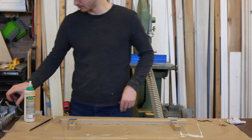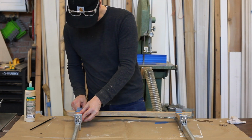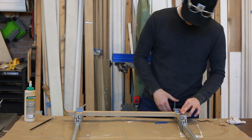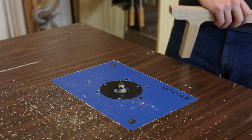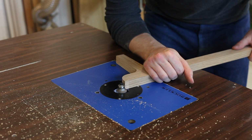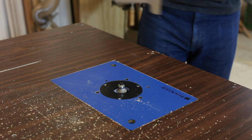And you can see right there the blue tape. So blue tape matches blue tape. I did all the mortising with blue tape up, and because of that, the components join together really well. After the glue's dried, I'm just going to put on a 1/4 inch round over just to soften up the legs a bit and lighten them up and make them seem a little softer.